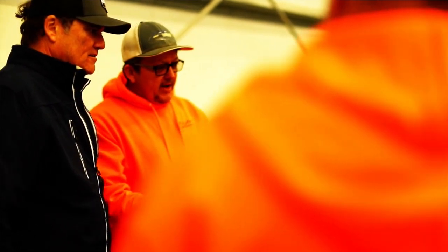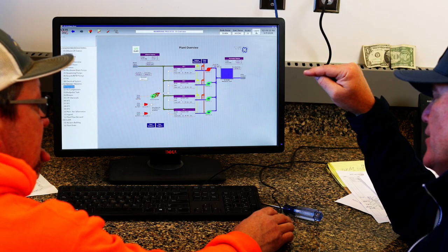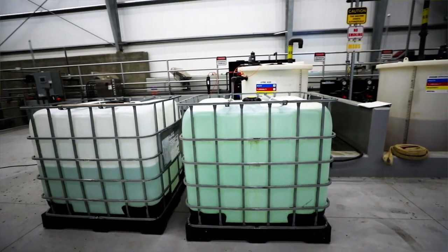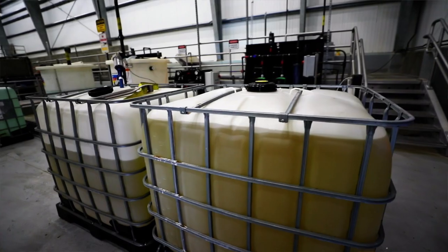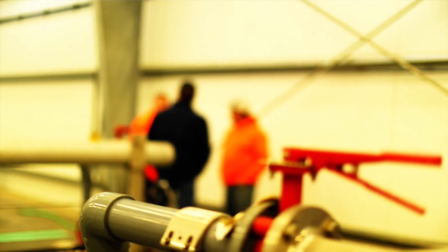You showed me something fascinating — bacteria that eats the waste. I don't know if people understand how that works, but it really is fascinating how the whole system works. Dirty water becomes clean water because of the bacteria. That's probably our main job down here: keeping that biomass happy. We do that by introducing air — we have blowers and mixers — and we keep a good eye on that. The operators down here are always running tests to help with our process.